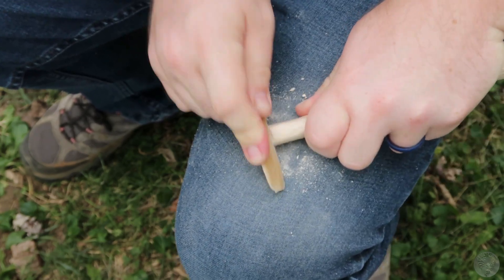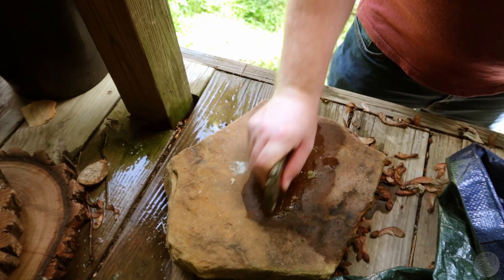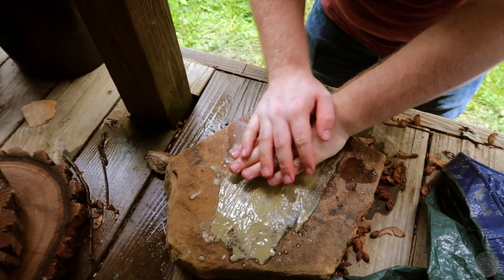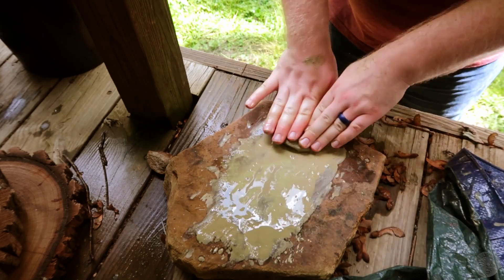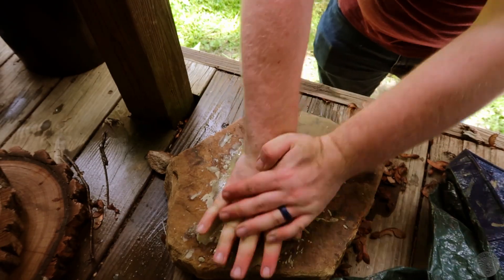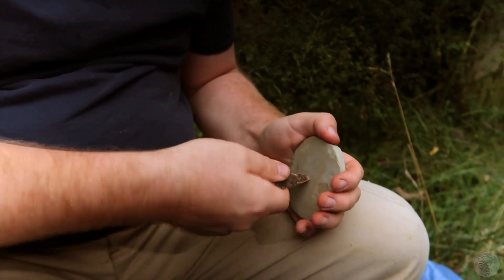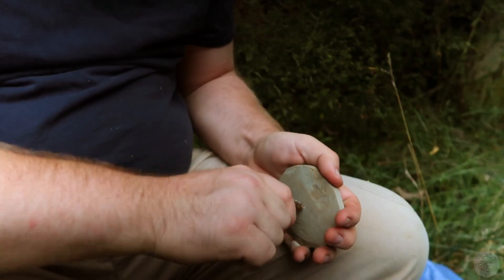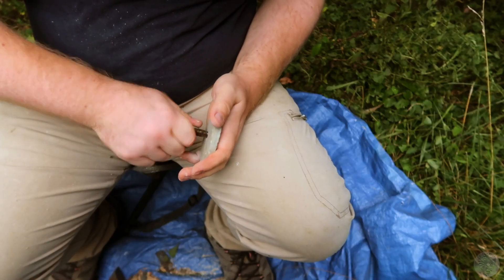In order to provide downward pressure and provide mass to help spin the spindle, we need to fashion a weight. A piece of shale is both nearly the right shape and easily worked. I grind the shale on a piece of sandstone, the gritty surface acting like a file or sandpaper to shape the stone into our weight. Water and sand combined together on the surface of the sandstone block adds more grit, allowing me to easily shape this soft piece of shale into a disk shape. Again, we need to drill through the center of this to fit the weight onto the spindle near where the bit is going to be. I make another flint drill for this task, this time using a speedily shaped biface rather than a flake. I twist this drill by hand until breaking through the opposite face, and then drill through the opposite direction to make the hole wider.